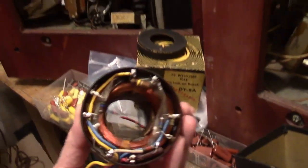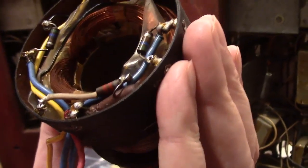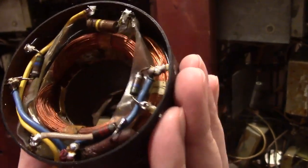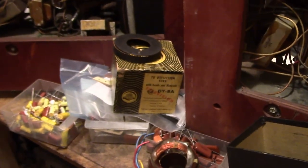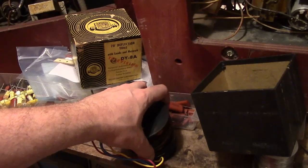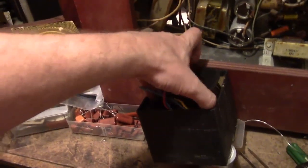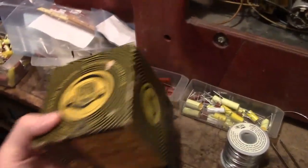The cover's falling apart a little bit. So what would be different? Well, we've got some damping resistors in here — 560 ohm, that's no problem. There's a cap; I've got to dig out what the value is on that. But there's also some extra resistors in here which this does not call for — I could clip those out. Here is the schematic for the yoke, and there's the impedance, the actual windings. I'm hoping it's close enough; I just want to get the set working. It doesn't need to be absolutely perfect screen geometry because it's going to go back in the cabinet with the proper yoke after I'm done.